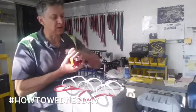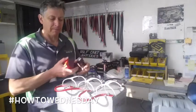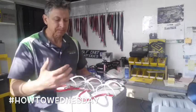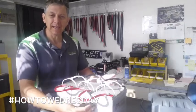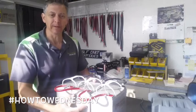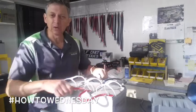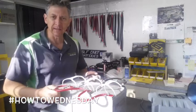In this example, I'm going to use these alligator clips of a charger. Think of my example as a reference to a solar charger, an onboard charger on a boat, or anything like that. As long as you have a bank of batteries — meaning more than one — it's very important where you locate the charging. In this example, we have 12-volt batteries hooked in parallel. Parallel means we are doubling the capacity or the amperage but maintaining the voltage, so we have a 12-volt consistent bank with more output. Parallel means positive to positive to positive, and negative to negative to negative all the way across, hooked in equal lengths with equal cable gauge.